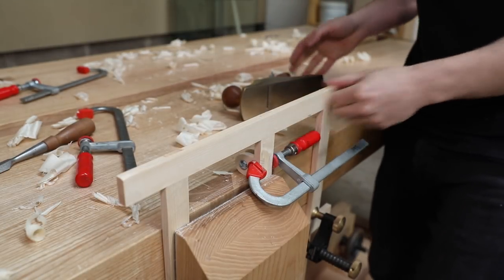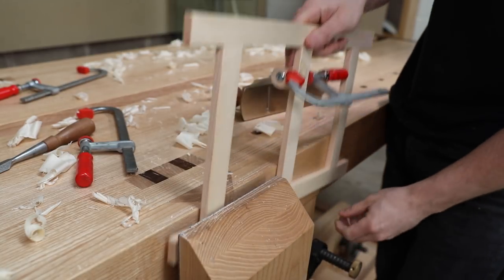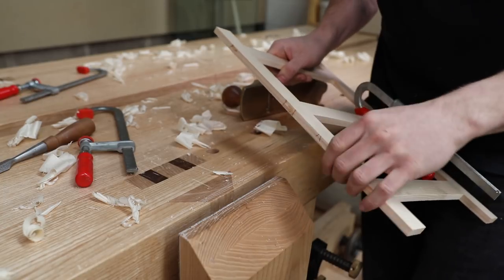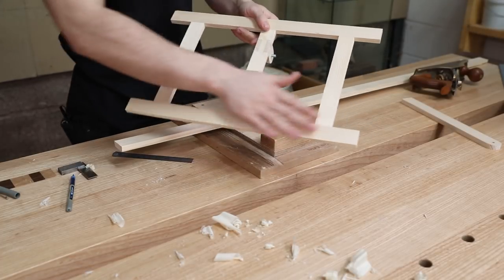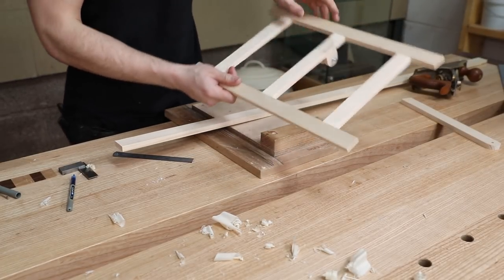As I said in the last video, it's always worth getting rid of these little bits in pine because when I chuck a stain on this it's going to be really apparent on those little rough areas that I haven't quite sanded or finished to the standard it should be. With that pretty much all planed flush, the next thing we can think about is the shelf on the bottom that the book sits on.